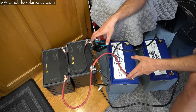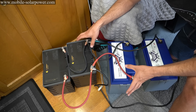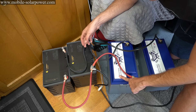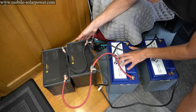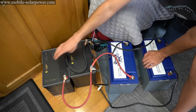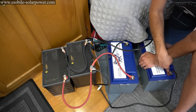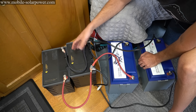This is how I'm going to build a 48 volt battery bank. You do not want to mix and match batteries — I have to because I don't have other 12 volt batteries around. I have two 90 amp-hour batteries and two 100 amp-hour batteries. When these are in series, I will only have 90 amp hours available from each one even though some have 100. Right now we are equalizing them. If you connect batteries all in series, they need to be the same voltage. Connect all the negatives together in parallel, then all the positives, and leave them connected in parallel for around a day so they reach the same exact voltage.